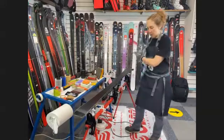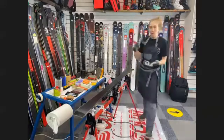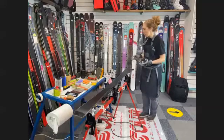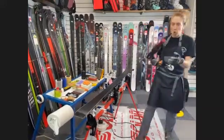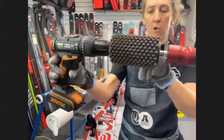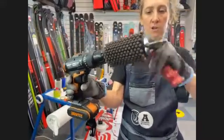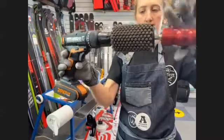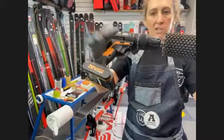So what we're going to do now, that's all brushed, it's looking nice and shiny. We're now going to use the roto brush to get a really nice polished finish. For any of you who have got roto brushes or want to use one, I'll show you. We've got the roto brush in here. This handle is a quick release handle, so the brushes can come off and you can swap to different brushes easily. It just clicks on. This can spin independently of me switching the drill on, and it is just a standard cordless drill.